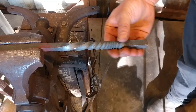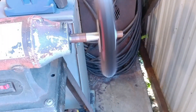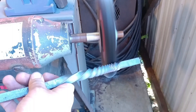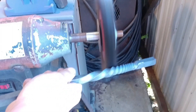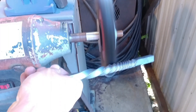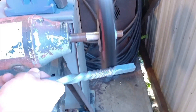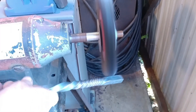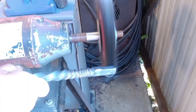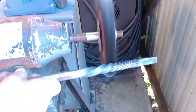We will show you steps three through five here, which is the finishing portion. We've got our rusty crusty little bar here and we're going to go ahead and clean it up on the wire wheel. Whenever you're working with twists, you want to try to work with the direction of the grooves to try to get down deep inside all the grooves and get them all completely cleaned out. As I said before, this is a buildup of different processes — a good finish is multiple processes being done well. So you definitely want to take some time here and get this good and clean. If you leave a little rough patch, it'll still be there when you go to finish the rest of the piece and it will not look smooth.